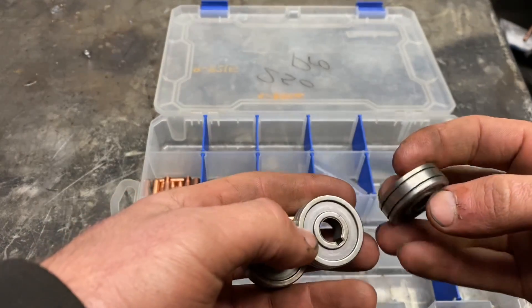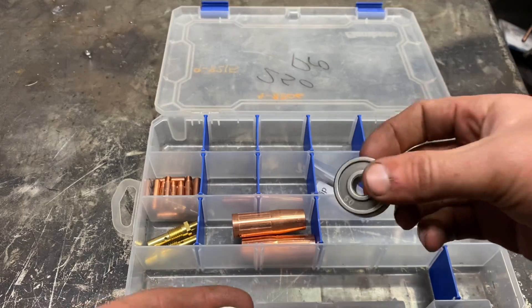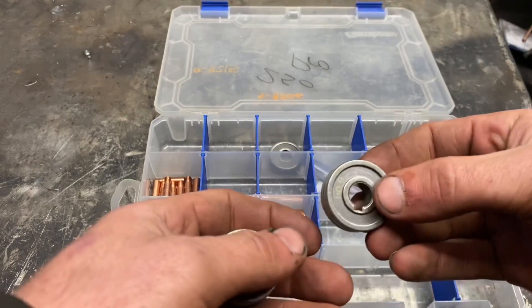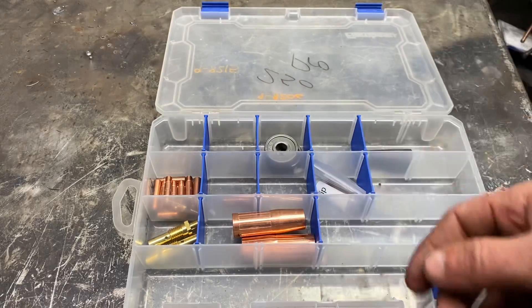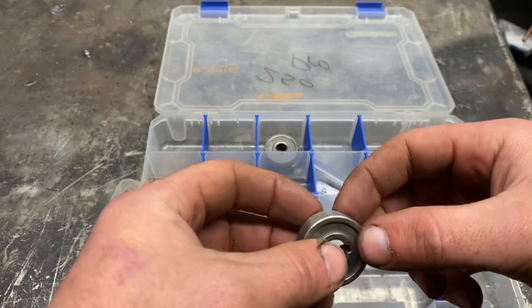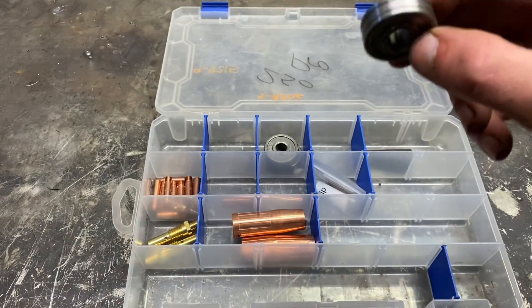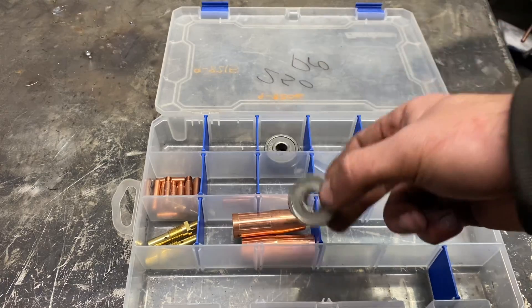It comes with a total of four drive rolls. You have a two-sided drive roll that's for flux core, a U-drive roll which is for aluminum, and this machine does come with a graphite liner which is for aluminum — I have not tried it yet, but when I do I'll make another video. And then it has two double-sided drive rolls for regular MIG wire, hard wire.